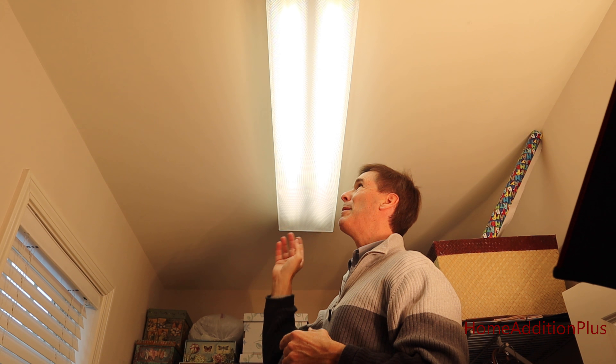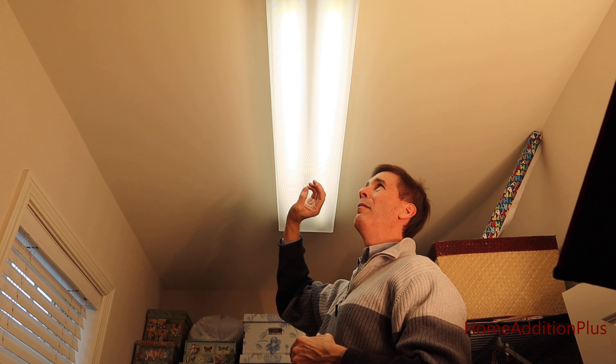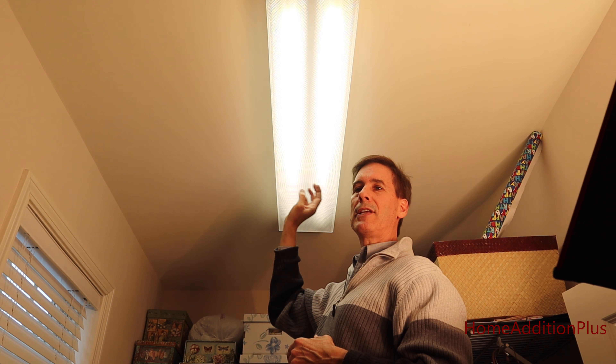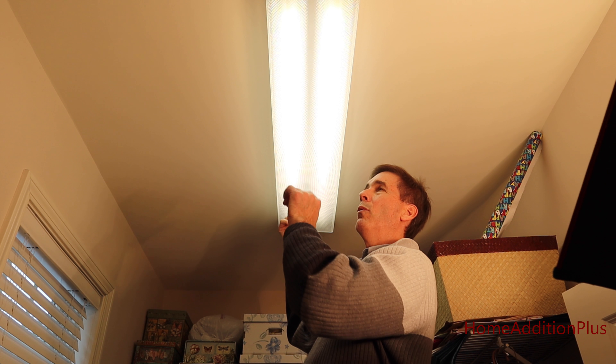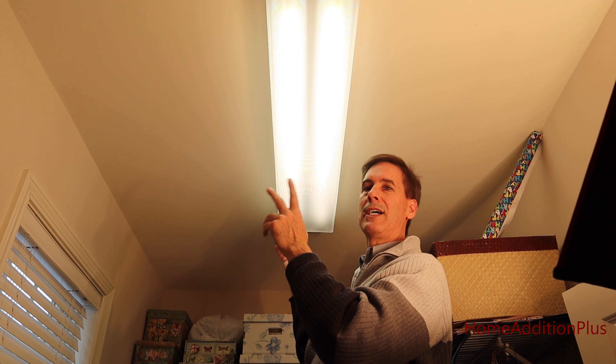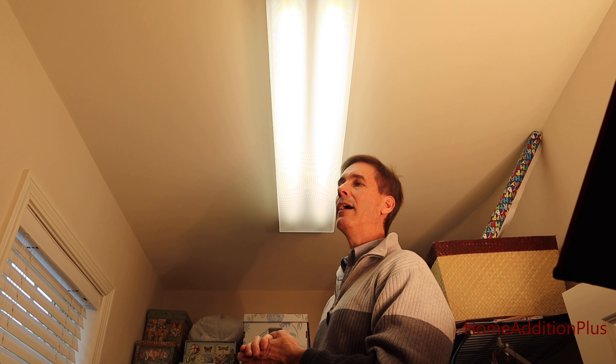So that's all it took — probably about half an hour to 45 minutes to get this job done. Basically, we found a replacement ballast that matched the same specifications of the existing one. We took out the screw to remove the ballast, cut the wires, and spliced in the ballast wires to the existing wiring in the circuit for the light fixture and to the supply line. And that was it. I like to not only put the wire nuts on, but also put a little electric tape around the wire nuts just to make sure nothing gets loose in the light fixture.